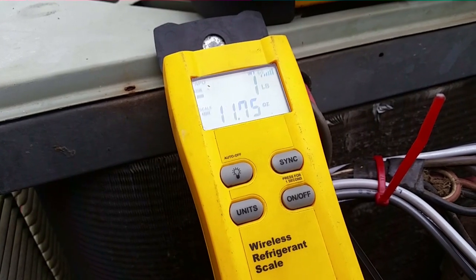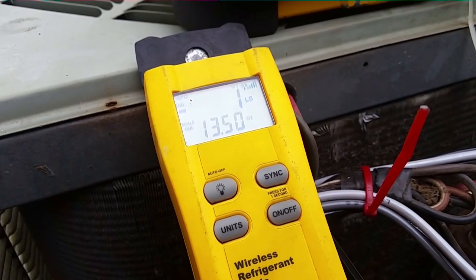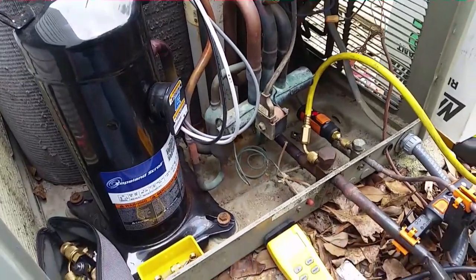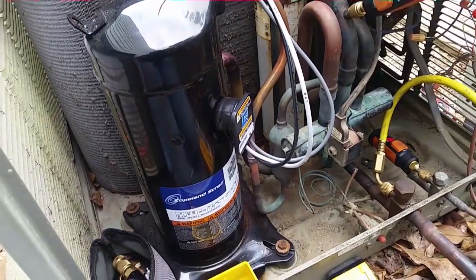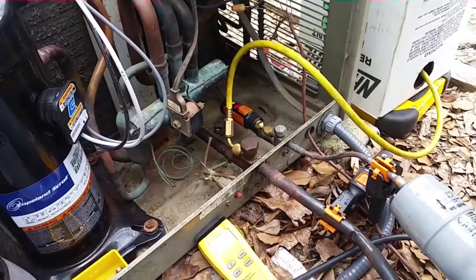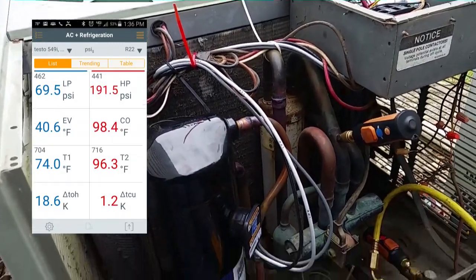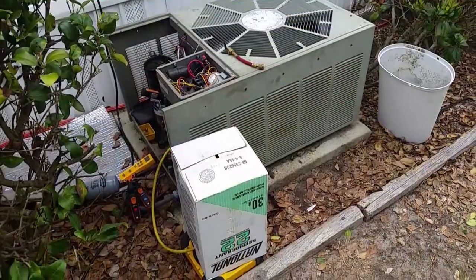I might go up to four and a half pounds. This unit is only 77 ounces total charge, so that's right around five pounds. I have the Testo smart probes hooked up — just hoping they don't explode on me. I've added around four to four and a half pounds of refrigerant. The compressor is running nice — sounds sweet. I had to strap off the discharge line so it's not too close. Suction pressure is a little bit higher because it's warm inside with limited airflow, so I'll keep adding until we get right where we need to be.